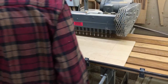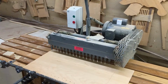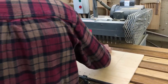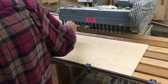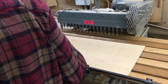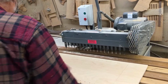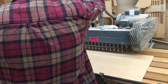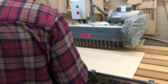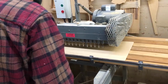Does that clamp in place at that spot? No. So you have to be holding it. I'm holding it there. There is an index. It's set back here right now, but they're all so different. It's time consuming to change that for each cabinet. These cabinets vary so much in width. It's just as quick to measure and put a mark there. And I just hold that where it is. If it's close, within a 16th or so, it's fine. And of course, that one indexes 1 1/2. You go, drill your hole.